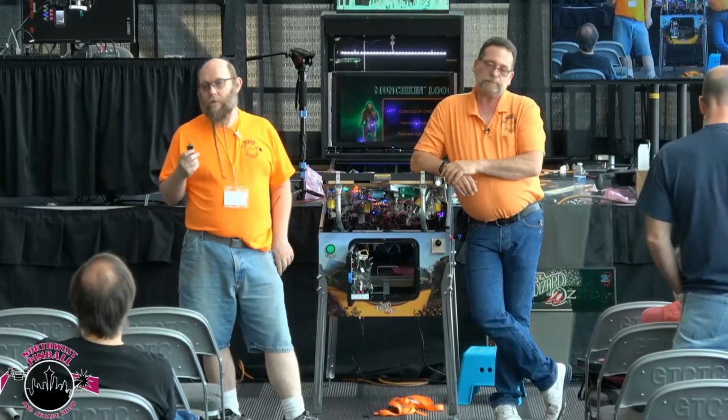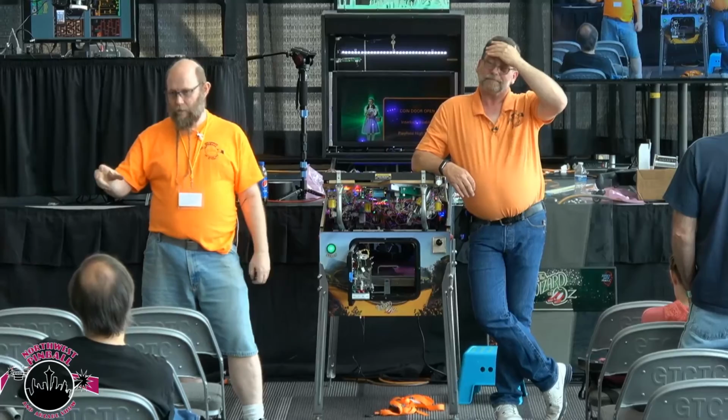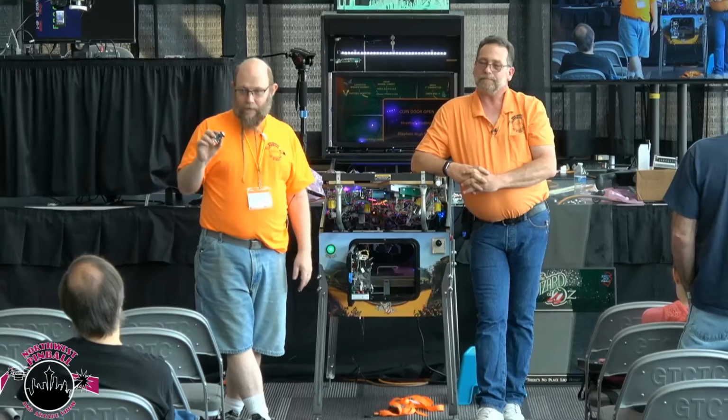If you have a real Pac-Man game, and your monitor has gone out, and you can't find a replacement, and you're stuck putting in an LCD because nobody will sell you one, you're going to need two things. You're going to need a converter board to take the CGA signal out of the game and convert it to a VGA output. That's going to result in a picture that looks like this. That will work fine. If you want to put the lines back in, you also need one of these, because I haven't seen an inverter or converter board that has this built into it yet.